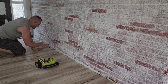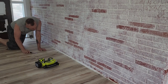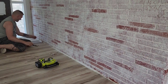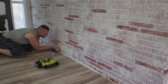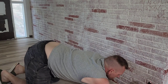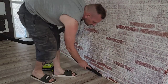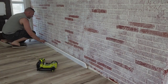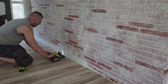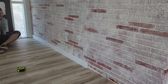Alright, moving on to the next day. I can't remember where I was this day — I might have been shopping for decor for this room. But Bobby was cleaning up caulk that was still on the wall from taking out the old baseboards so we could put in the new ones. I've had a lot of people asking what type of baseboards we've been doing. We've been doing 1x4 boards painted in trim white, just pure white. I really like the thickness of the 1x4s and the modernness of how square it is. We've been using this all over the house — it's a lot cheaper to buy a 1x4 than a trim piece that's practically the exact same thing.